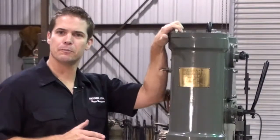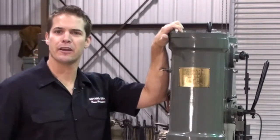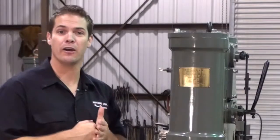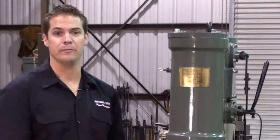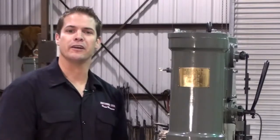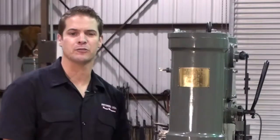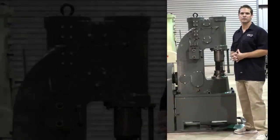When looking at purchasing a power hammer, keep in mind that ram weight isn't the only factor in determining the hammer's hitting power. A lot of Anyang's hitting power comes from a high volume downward air pressure, not just the hammer's ram weight. This is why a self-contained air hammer can forge larger stock more efficiently than other hammers in the same weight class. The construction of this hammer is both smart and simple.